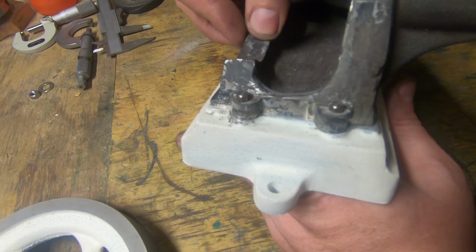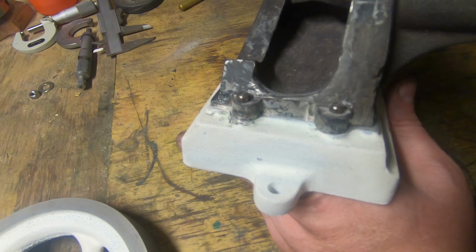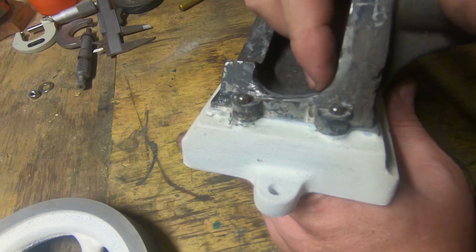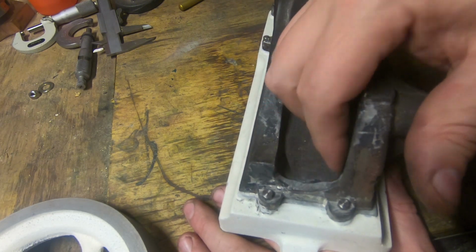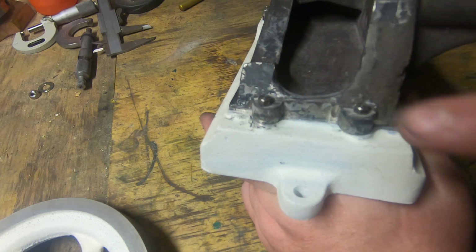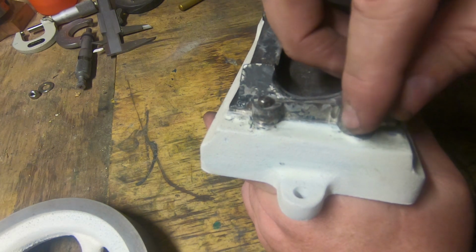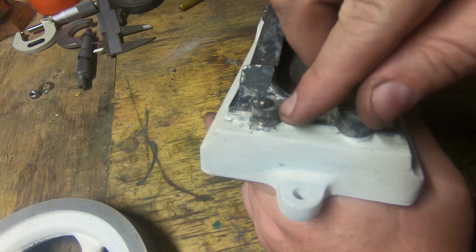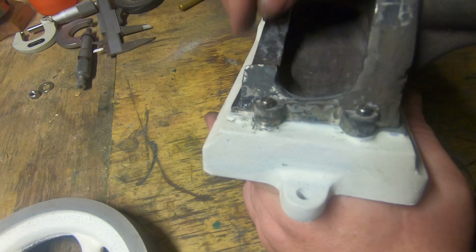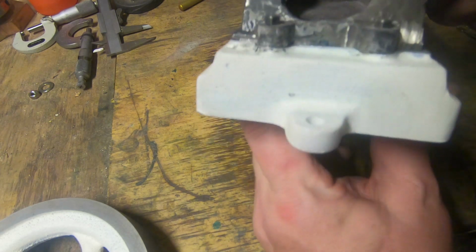This is coming up pretty nice here. We've still got a hollow in there. This is filled up beautifully. Still got a bit of a hollow in there, but it's not too bad. I'm probably going to clean this up. This is filled up beautifully in here, which I'm really pleased about. And these want a bit ground off the inside here just to bring them in keeping with the rest of the holes, the rest of the lugs. So I'm probably going to hit these with a grinder and take them back in here a couple of millimetres. Clean that up. And it probably still wants a little bit in here. But apart from that, these are coming together.